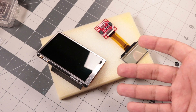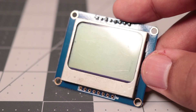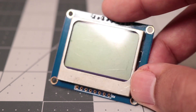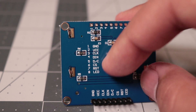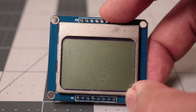We'll need a few things to get started. When concocting any gadget that has a user interface, the first thing I like to think about is the display. For this project, it's time to say goodbye to my beloved OLED displays and full-color LCDs. We're going full monochrome. This small display might be tiny but it is mighty, because it was once the main display of everyone's favorite indestructible cell phone, the Nokia 3310. And while it might only have a resolution of 84 by 48 pixels — laughable by today's standards — it is totally what we want for the retro aesthetic, and most importantly it's low power, runs off 3.3 volt power and logic, and has a regular SPI interface, which means it's going to be crazy fast.